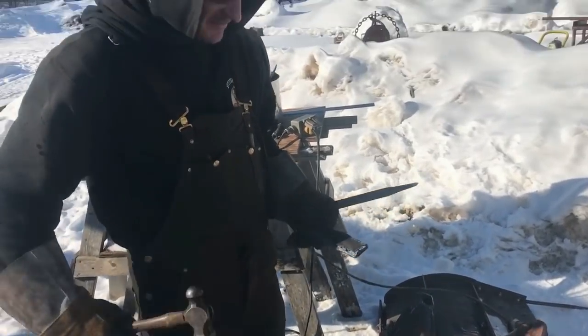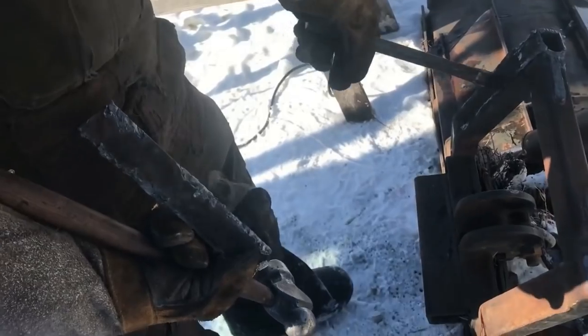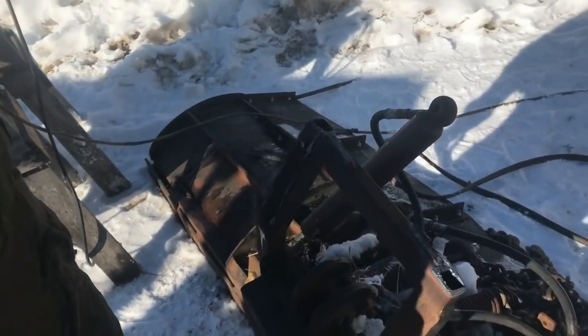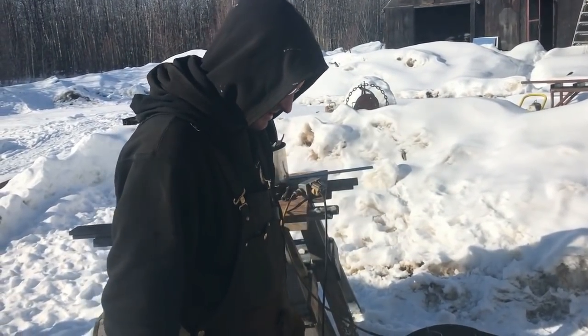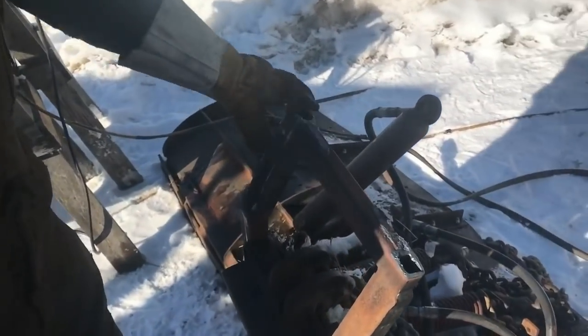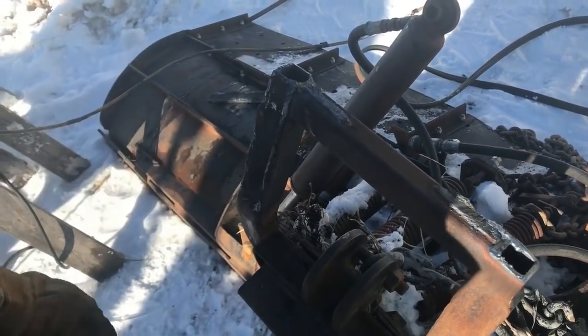You don't worry if you have to take it off with a chisel. You don't care about the one main plate. You want to keep the structure. Because you're burning hot and cutting that weld out, there's usually a lot of rust and everything in there. So you just leave yourself enough meat left and you can take it off with a grinder. See, we just rough cut it, and we'll shave all that up with a grinder.